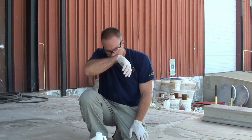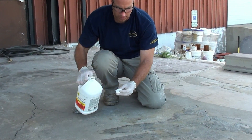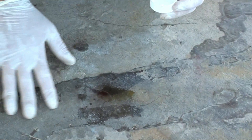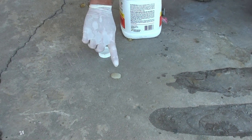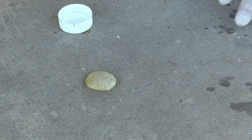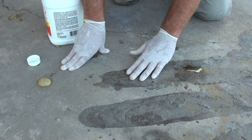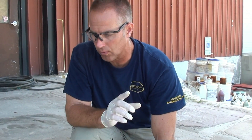It's really important to make sure that your slab is also sealer-free. If you're ever not sure, the easiest way to test is to get some muriatic acid and just put a little bit on a concrete surface. If it's sealed, it won't bubble much. If you look at this, this really isn't doing much — because this is sealer, and this is telling you that you've got something on the surface that can debond your product. If you look over here, see how vigorously that bubbles? It's bubbling like a pot of boiling water — so there's no sealer on this side. It's important when we do our surface prep to get rid of the sealer so that you don't have anything that can cause a delamination down the road. The same applies to grease, rust, or dirt — anything on that surface, we have to make sure we get it off. We're going to show you the techniques to get that concrete squeaky clean.